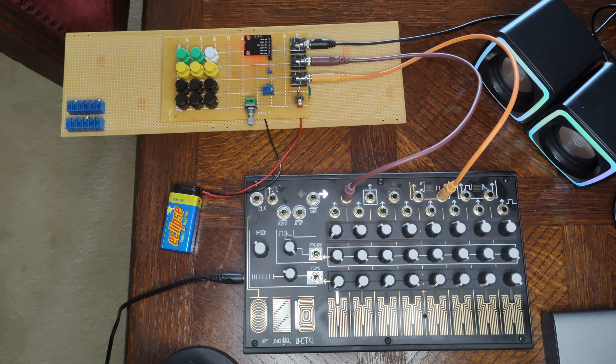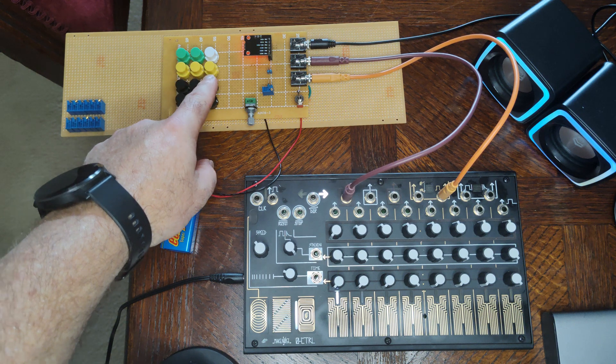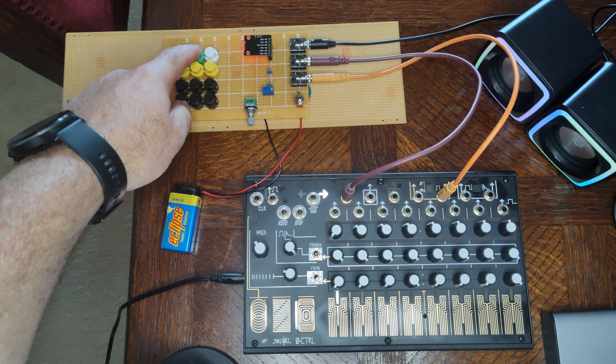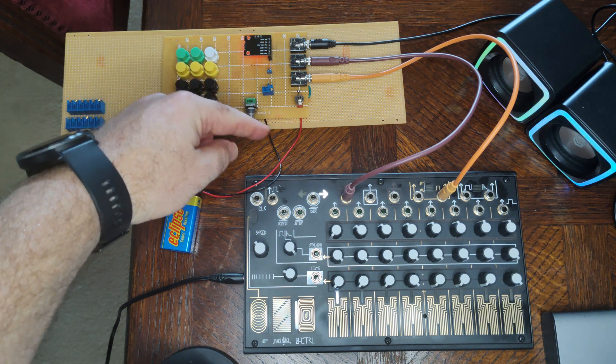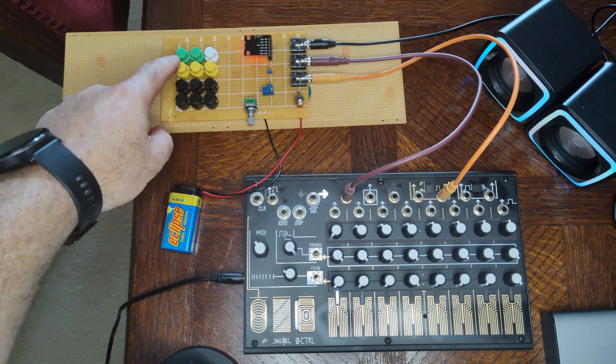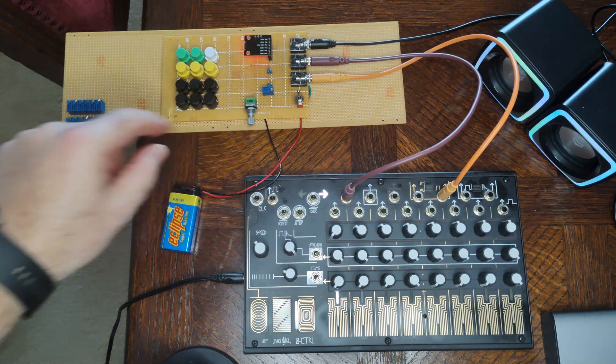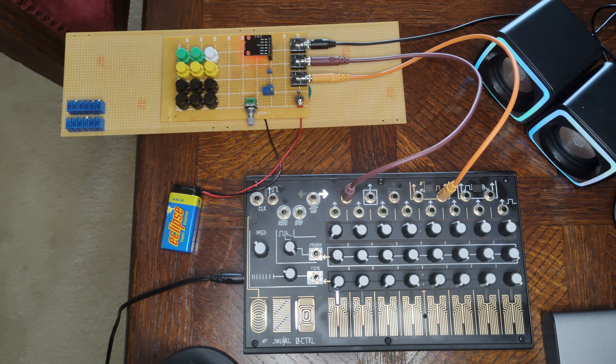Hopefully I'll have another video soon showing the completed setup. You'll be able to select your oscillator — one through six — choose the strength and phase of each, or start from a preset. I might make a few more presets depending on the memory. There's only six kilobytes of flash in there, and everything you've heard so far, including all the presets, uses about two thirds of that — about 4K. It's actually far more efficient than I thought.